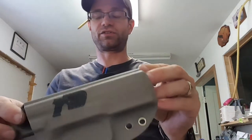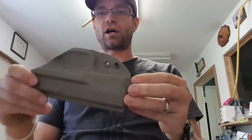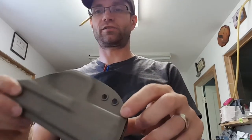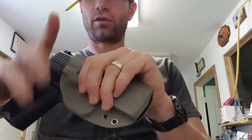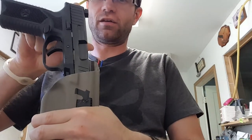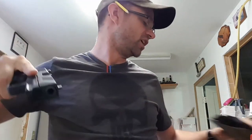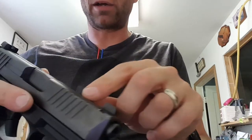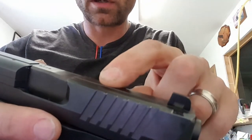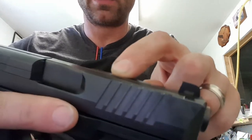This color is called Coyote Gray — kind of a neat color. It goes pretty good with our gray eyelets. This was the first test holster that I made, and although the fit is fine — snug and everything — as you're putting the gun in you're just getting more drag than is necessary. After doing a little bit of work on the serrations, you can see that the serrations on the top edge there are just rubbing on the inside of the holster.